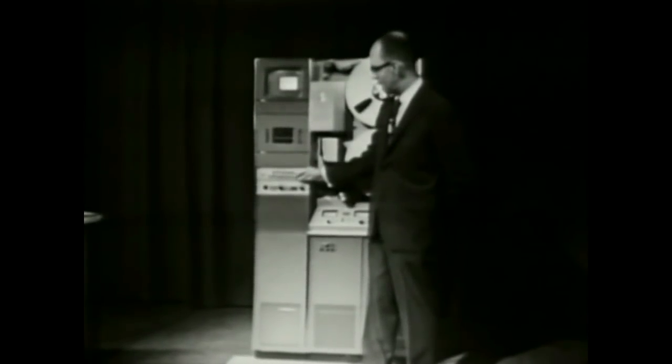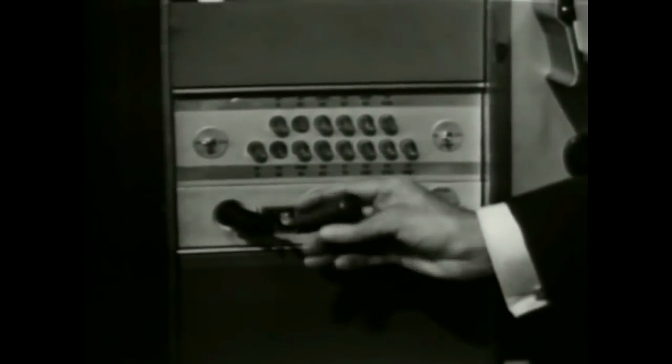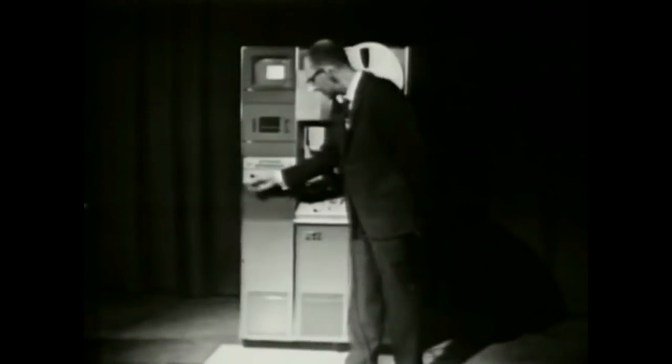There's a rather complete group of switches here for monitoring various signals at strategic points in the machine. The upper row of buttons controls the display on a picture monitor. The lower row of buttons is associated with a built-in waveform monitor or oscilloscope, which is an important item in the overall machine. There is also a microphone mounted in a retractable holder, which enables an operator to add identifying information or audio notes to be applied to the cue track for identification of recordings or notation of any technical difficulties encountered.